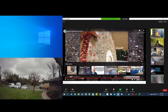Do you guys see how the pad has literally been just degraded down to the point it's into the pad driver? And it is just totally dissolved. That is somebody not checking their pads and replacing them regularly. This is a perfect example of what never to do with any floor pad, because you will destroy a floor.